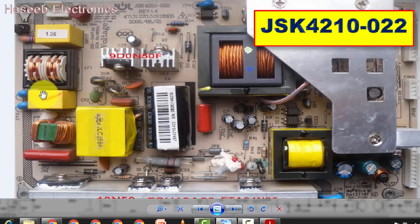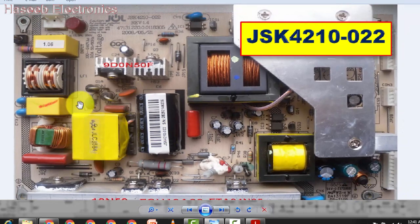In the top left corner of the schematic we have the input — line and neutral — then a fuse, a dual line filter with first and second stage for removal of harmonics, a class Y capacitor, and a bridge rectifier. This rectifier will rectify the voltage and charge the capacitor to the mains voltage, which will turn on the standby section. From the standby section we take 5V out. When we receive a power-on command, first it turns on the PFC circuit, which has a MOSFET, rectifier, and choke. It charges the bulk capacitor to approximately 400V, then turns on the push-pull power supply section, and we also take 5V from this section.